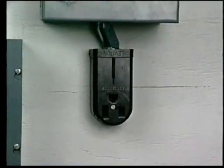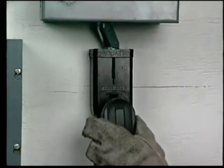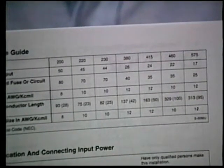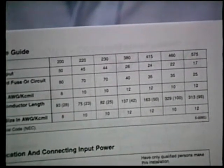The owner's manual instructions are clear on how to change the primary voltage. The primary power cord can be hardwired to a fused line disconnect electrical box, or an appropriately rated pendant with a female receptacle and a power cord plug can be used. The electrical service guide in your owner's manual has specific information on wire sizes, fuse ratings, and maximum wire lengths for various shop voltages. This example is from the Millermatic 250 manual.